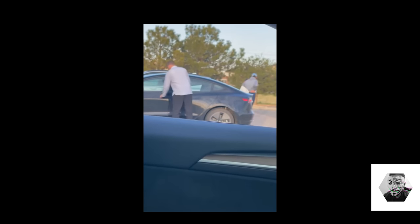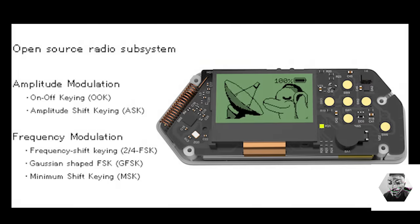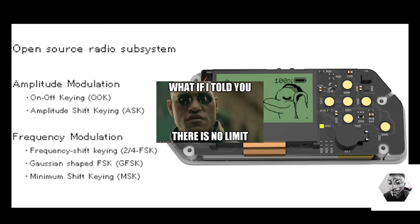You can also create a blank remote for new wireless gates if required — simply select a new band within the menu, register the new key, give it a unique name, and navigate to it. The CC1101 is a well-known universal transceiving frequency chip for low-powered wireless applications. When using open source libraries, developers can interact with radio subsystems without any limitations — you can write any wireless application, custom protocols, or decoders found in the open source community, as well as find new connections for IoT devices around the house.